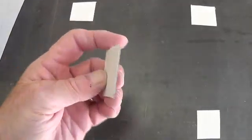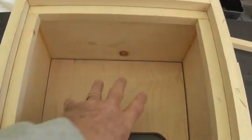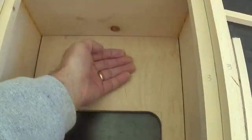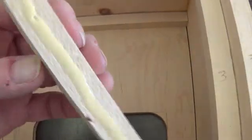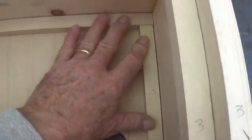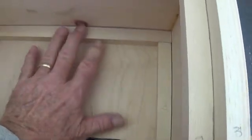To very slightly recess the back door to compensate for the upholstery material thickness, I'm going to use some about one-sixteenth inch shims which I set down on the table, and then I'm going to set the back door down on the shims so that it's elevated off the table about a sixteenth of an inch. Then we set the cabinet down so the back door is in position but it's about a sixteenth of an inch above the table surface. With the back door shimmed up just a little bit, we are going to glue the cleats to the walls of the cabinet. Be sure you get no glue on the back door — don't glue the cleat to the back door. This is just temporary to hold the cleat in the exact position so that we can nail it. We'll let this glue set up enough to hold the cleats exactly where they need to be before we start the nailing procedure — this should take just a couple minutes.